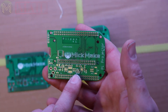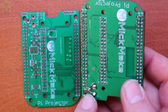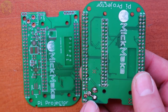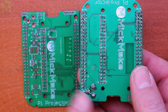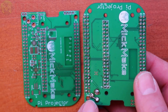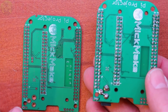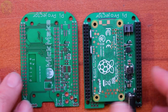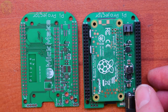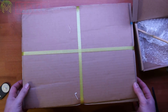I've also added a header for an external thermistor, so if you want to check on the battery and not charge it if it gets too hot, you can do so. There were also a couple of problems with the previous version of the PCB — I had the DC jack connections around the wrong way, so I had to solder a bodge wire in by hand. Of course, version 2.1 has that fixed up. I also inverted the logic on some of the signals, and anyway that's all been fixed up.